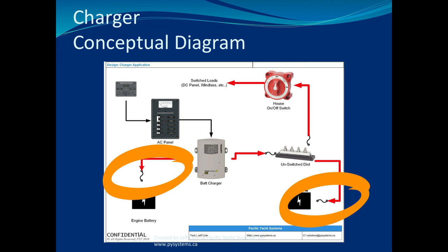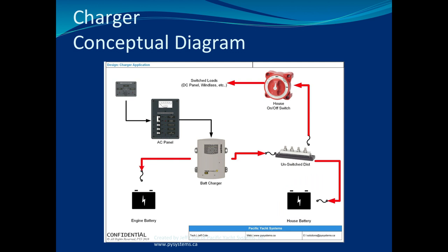Now, in most cases, you won't have a fuse, because people don't read the manual, right? But if your installation is done right, you're going to have a fuse on the circuit. And sometimes, remember this, fuses are not just on-off; there are some that are resettable, thermal circuit breakers. I was on another boat just recently, another call out, and someone did understand what a thermal circuit breaker was, and they pushed a button, nothing happened.